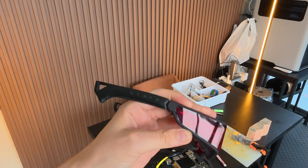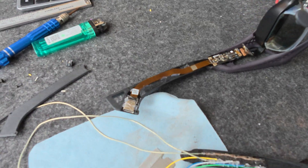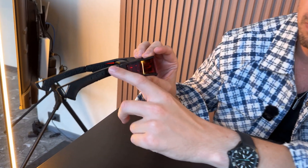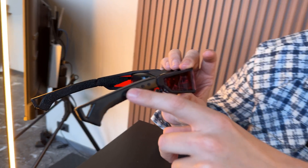Here is the final product. The frame was actually from PCBWay — this is carbon fiber, printed immaculately. The arms I built myself. We have two different ports here: one goes to the glasses connecting the wire into the computer, and the other is magnetized, going into the glasses powering the light and cameras. I have a bunch of room here to do other things. There are camera attachments for Xreal glasses, but there's a lot better things to show after this. I soldered into all the joints and created my own buttons — this one turns off the glasses, this one turns brightness up, this one turns brightness down, and these turn the lights on and off in different modes.